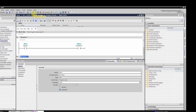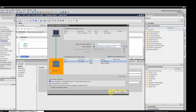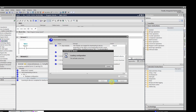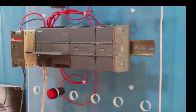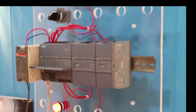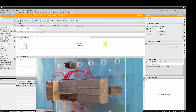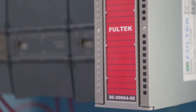Next, we download that program to the CPU by clicking 'Download'. To simulate it: when we turn on the selector switch connected to I0.0, you can see the light turns on. When we turn it off, the light also turns off. In the online view of the software, you can see that when the selector is turned on, the output Q0.0 is also high. That's what we programmed in today's class. Thanks for watching — take care and Allah Hafiz.